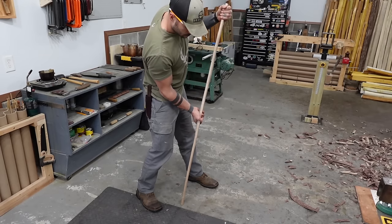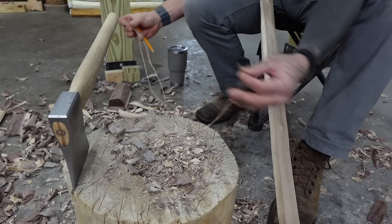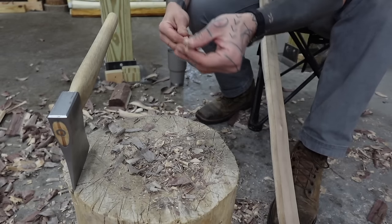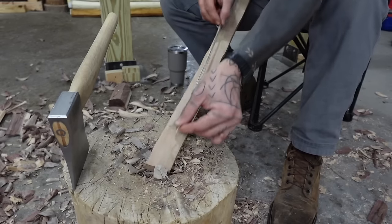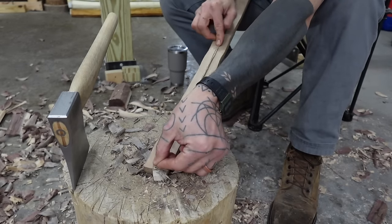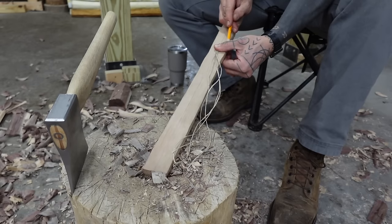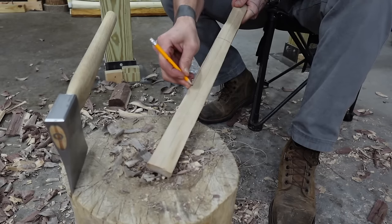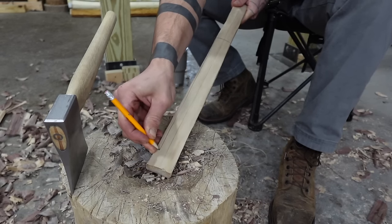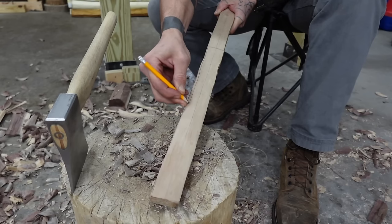It's got a little bit of bend now. Fold your measuring rope in half again so that it is now 1/4 of the length of the bow and make a mark on each limb. This will be where the limbs taper to the tips. Now I'm tapering the tips by eye and making sure my lines are gradual and smooth.